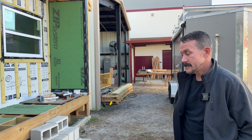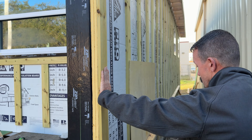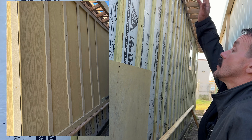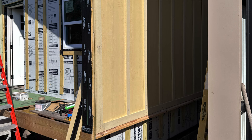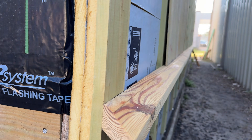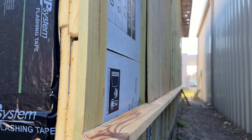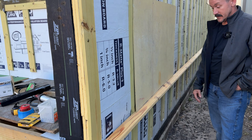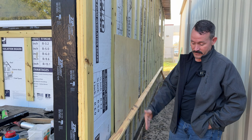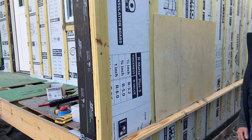What you're looking at here is two sheets of poly ISO plus a three-quarter-inch furring strip, and then we'll mount our siding on that. We're going with sheet siding — a board and batten — up to our eaves every 16 inches with a batten. We put this ledger board here because we're going to use a different siding on the lower half. It's just a piece of two-by-four cut at a 15-degree angle to give us some runoff, with a relief cut underneath so any water will hit that and fall away.